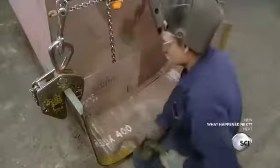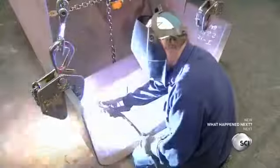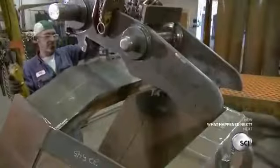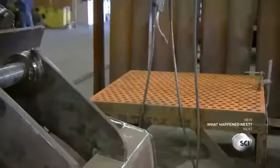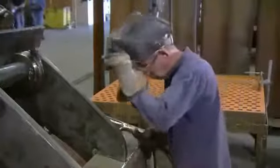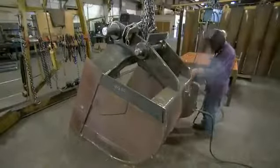He guides the blade into position at the front of the bucket and welds it to it. When this weld is complete, he'll remove the steel template. The attachment plates have by now been linked by thick pins. They lower it onto the top of the bucket, and it fits snugly to the arch and to the back wall. He welds the attachment assembly to the bucket.